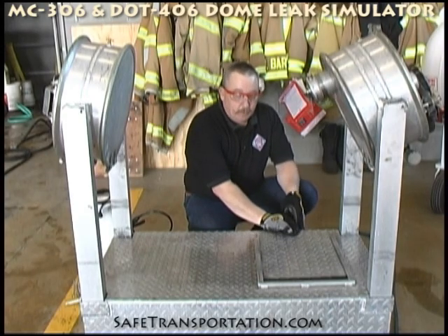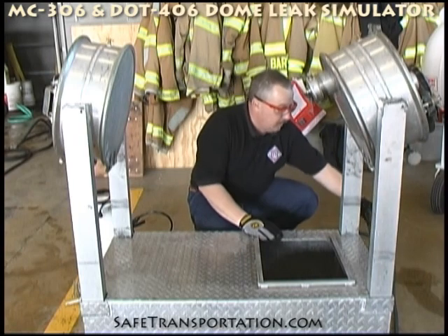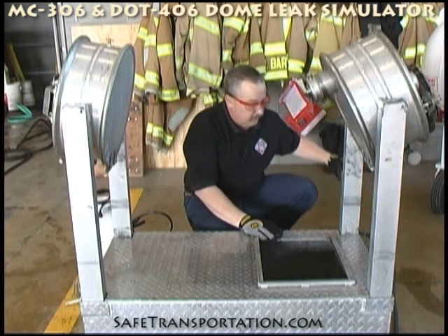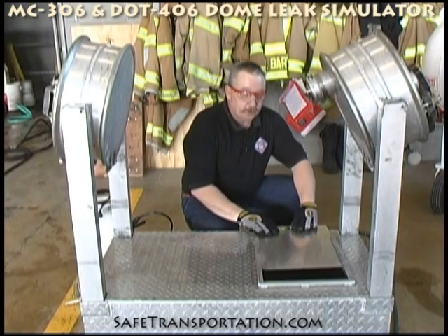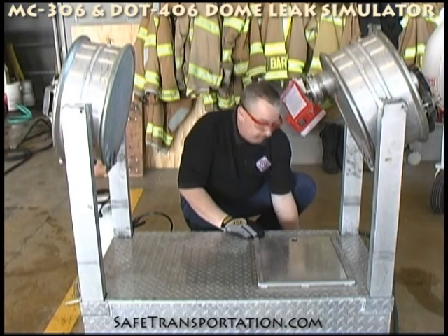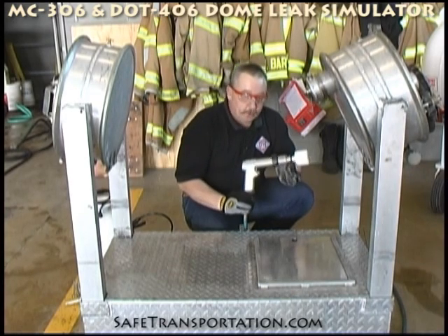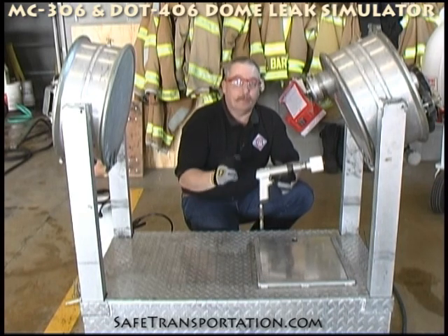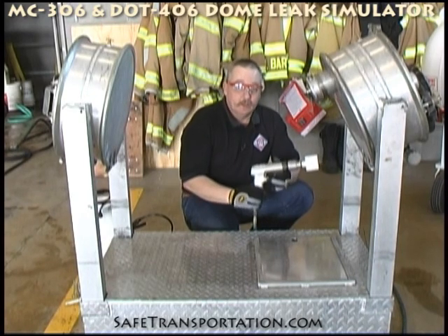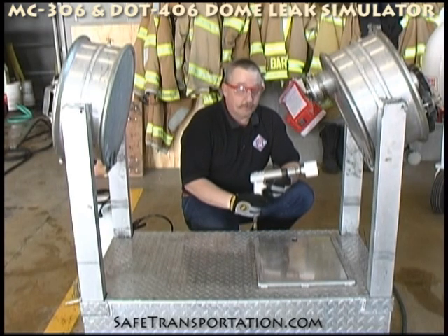All of the kits will come with a removable plate, and then you'll slide in a new plate that will allow you to practice drilling through the aluminum. We're going to also emphasize that you need to use a pneumatic drill. We don't want you introducing any kind of battery-operated or other electric drills.